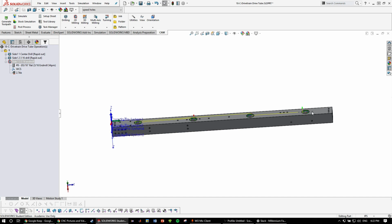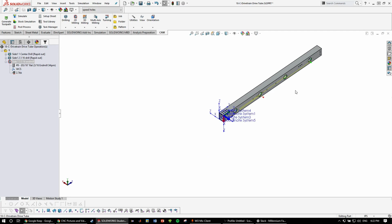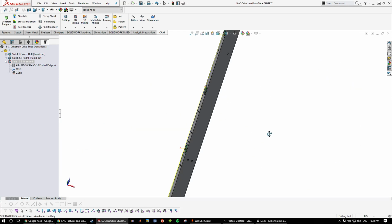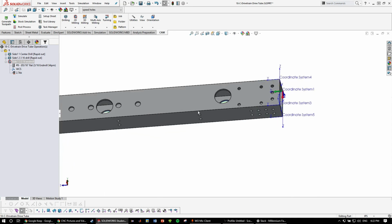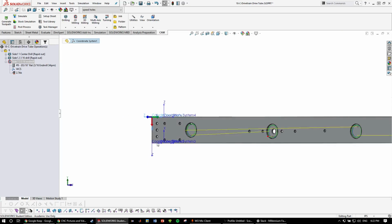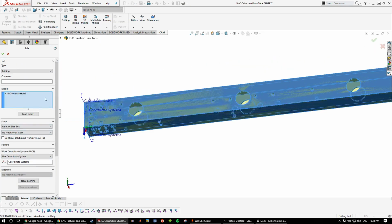Okay, so this side is fully done. So now we can move on to the next side. This side right here. Or actually, since if you look on this side, there's not very many. There's only these 8 holes right here and nothing else. We're actually going to take a look from the other side, the reverse side, and you see there's more holes here. So you're actually going to want to make all of your holes on this side and drill all the way through, but you're going to want to skip these. And this side is only drilling as well. So we use this coordinate system, this one right here, to create a new job, since it is a separate coordinate system, different zero.